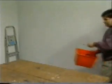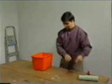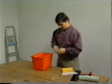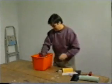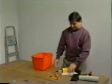As you can see, the first piece of equipment required is a wide-width paste table, which allows you to cut your lengths of wall covering and carry out any other procedures required for the installation of wide-width vinyls, such as damping the back of paper-backed products. Alternatively, use a sheet of material wide enough to support the product.